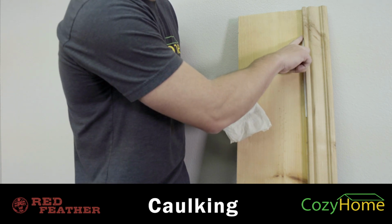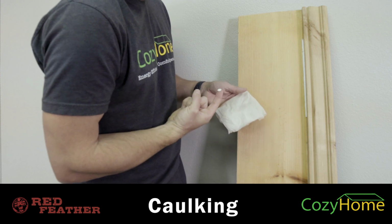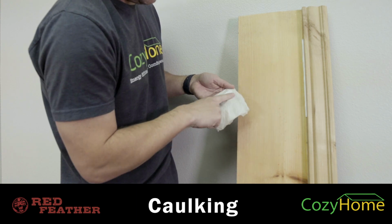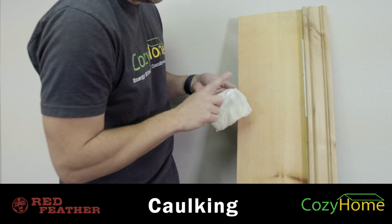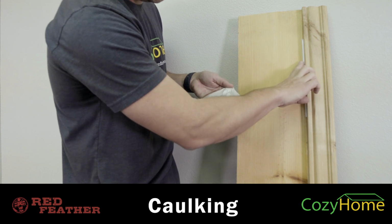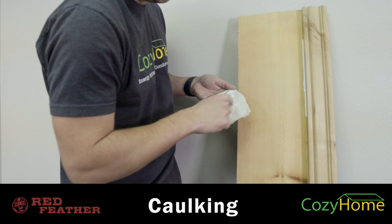So what I'm going to do is just do a little bit at a time. As soon as I get about that much on my finger, I'll wipe that off. And do a little bit more, and then wipe that off. And just keep doing that over and over again. If you try to wipe too much or go too far with it, the caulking squishes out the side and it doesn't look very clean. So I'm just going to keep doing that.